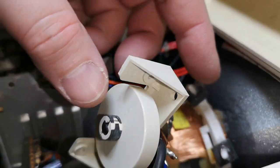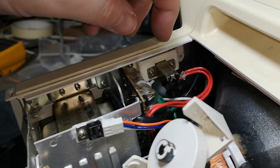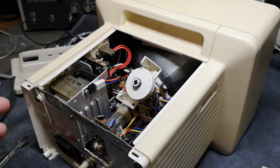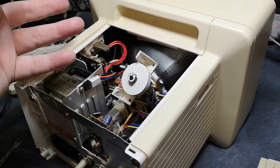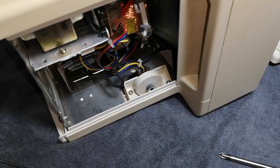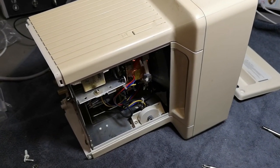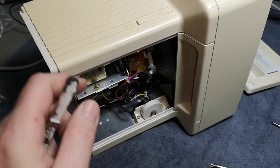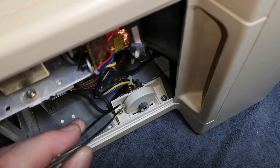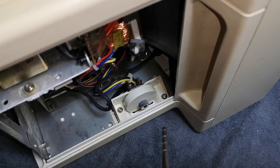And it's of course the same thing on the other side. Access those screws and then do a little bit of funky stuff. But that's a little bit typical Apple, you know, super sexy design that wins over easy to assemble and easy to disassemble. That's just how it is. Here's a very short trick. Just let gravity work for you instead of against you. So put the monitor on the side while you're playing around with those two screws. As you see here, now they're not falling anywhere. They're falling exactly where they're supposed to be, right?